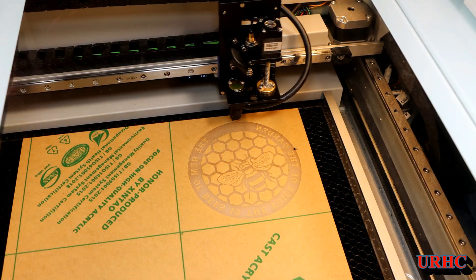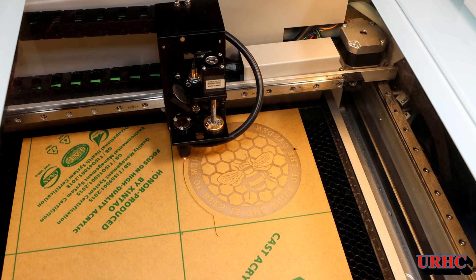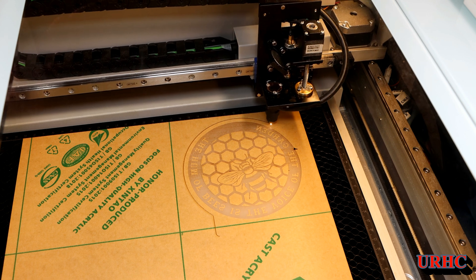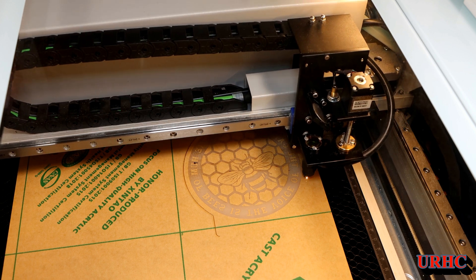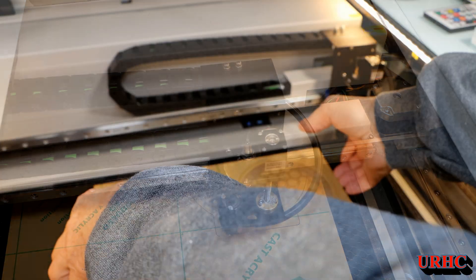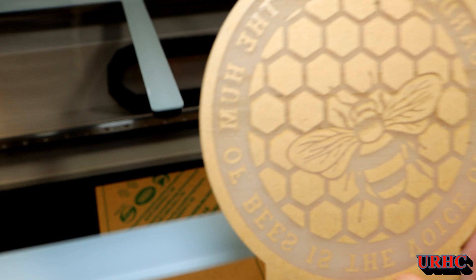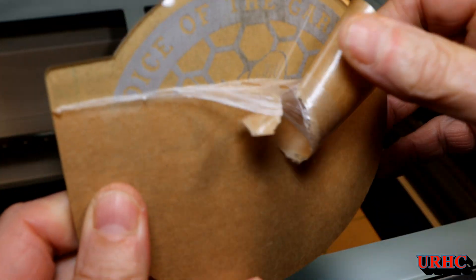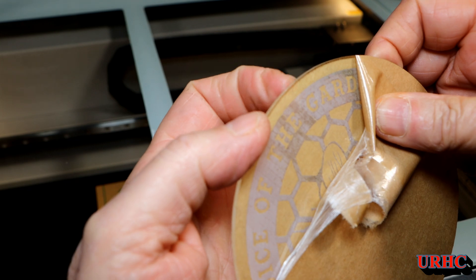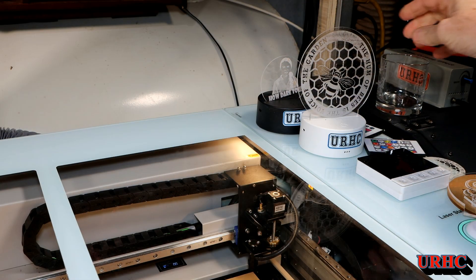With cutting you always have to use the air assist to cut clean through and get a good cut. I'll put the settings at the end of the video. This first one was done with air assist on and the lines in the horizontal position — you can see right off the laser it's pretty crummy. It's inconsistent depending on how far it was moving, and you can see all the clouding from the lines disappearing into the melted material being pushed back in.